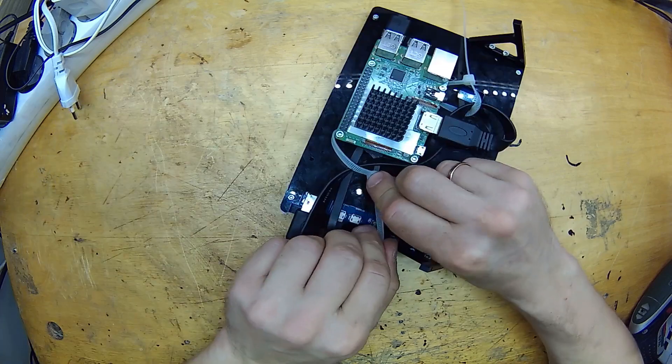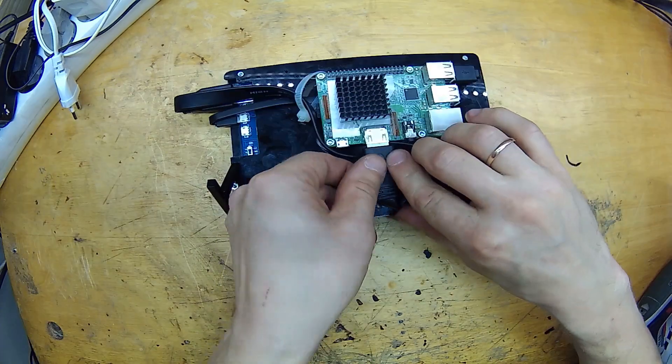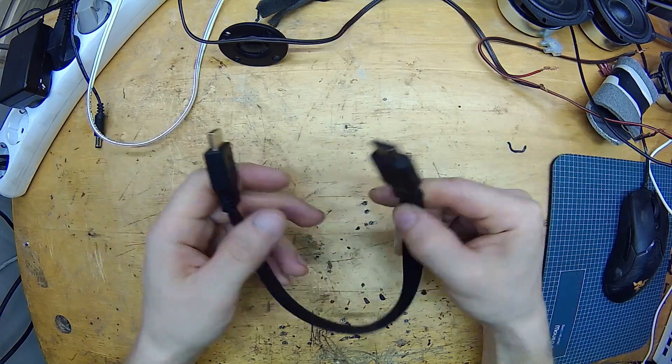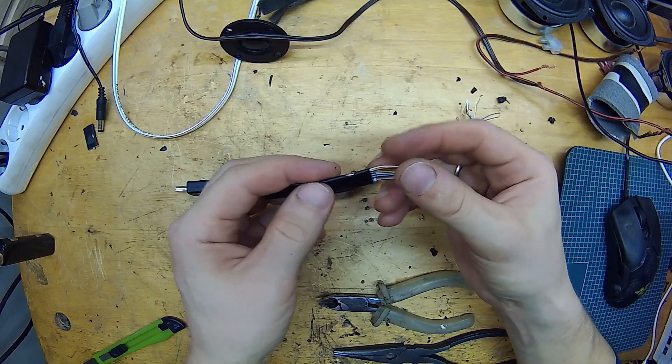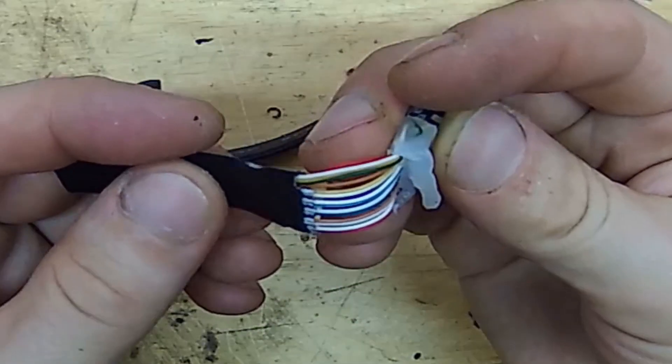I did try to make it nicer by manhandling cables and using some zip ties. And guess what? Wi-Fi stopped working. Apparently using an unshielded HDMI cable creates so much radiation that it blocks Wi-Fi. This cable I got in the bundle is a bad kind of garbage — I took it apart and discovered that the shielding layer wasn't even connected. During this hassle I also stumbled on a possible reason for losing Wi-Fi connection after some period of time.